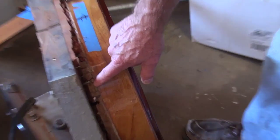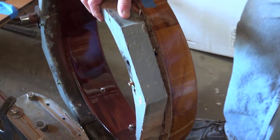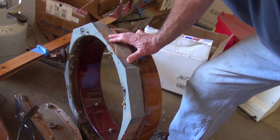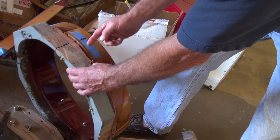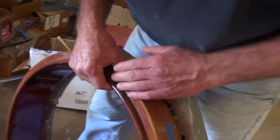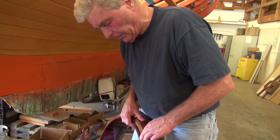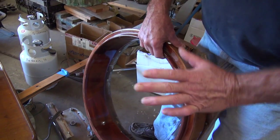We are looking at the lazarette hatch, and you can see the actual deck thickness here from back in the day. This hatch is a real pain because of the way the subframe is built in four pieces — we're going to do it a little differently to make it easier. The bolts come through the frame, through the hatch, through the deck, and are buried in here, and because that plug goes a little bit up into this lip, you have to take a lot of care to get that plug out. So when it goes back together it looks right — this is why they call it work.